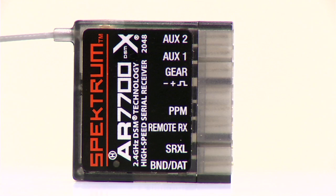I'm also noticing the receiver has PPM stream outputs — three channels. What would somebody use those for? Those are the auxiliary channels — Gear, Aux 1, and Aux 2, basically channels five through seven. On mid-sized quadcopters you might have a camera gimbal application — these are conventional servo outputs, so you can connect a camera gimbal directly and control mode, yaw, and tilt. That makes it simple: you go straight off the receiver without having to go through the flight controller for camera operations. On an FPV airplane you might use them for retractable landing gear or flaps.